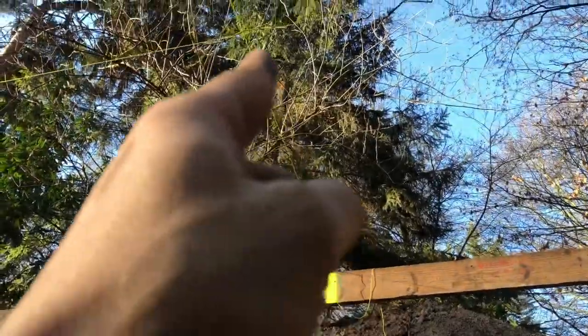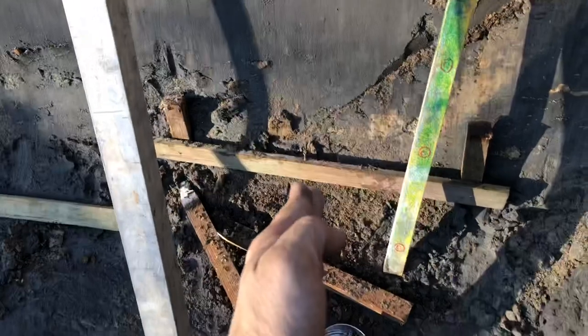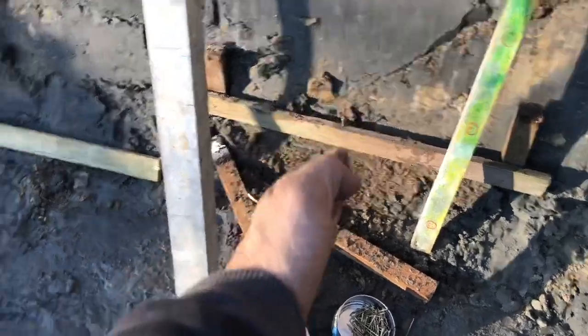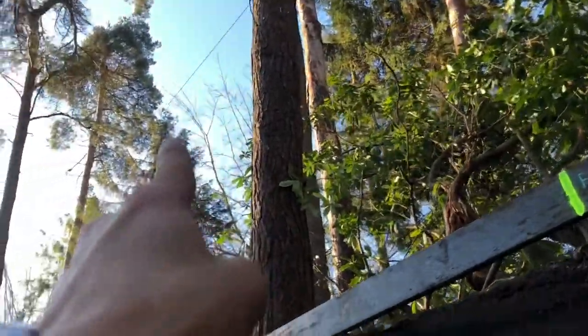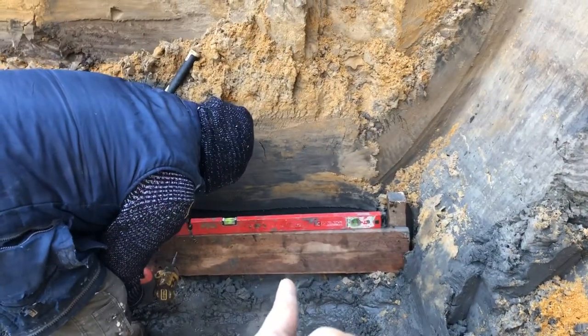So that line, you can't see it well, but it's there. I put this line on this bridge. Then we can easily determine where the plate is. Eh? This rope is the wall. We're gonna put the rope. We're gonna plumb it down and write it down on the bridge here. Then we have the line. Then we know exactly where to dig the plate.